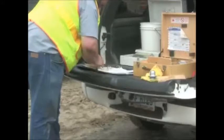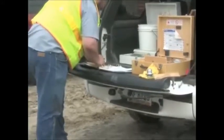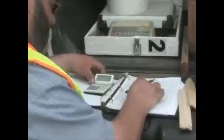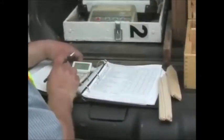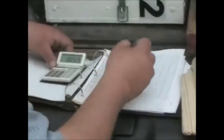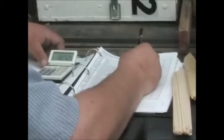The tester gauge dial reading that was recorded is the percent of moisture by wet weight and needs to be converted to dry weight. Using the number recorded from the gauge dial, obtain the moisture percent from the conversion table for the speedy moisture tester provided with the kit. Complete necessary calculations.